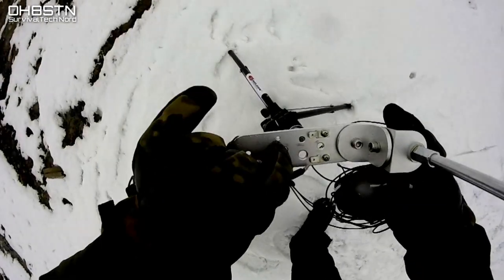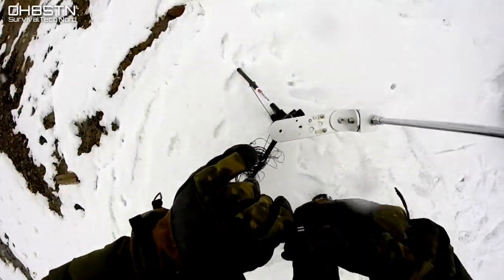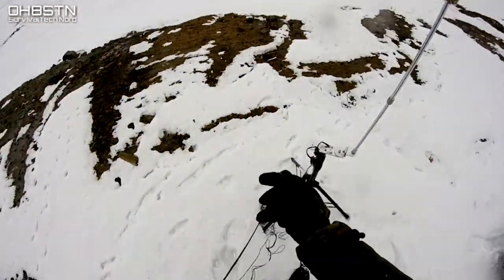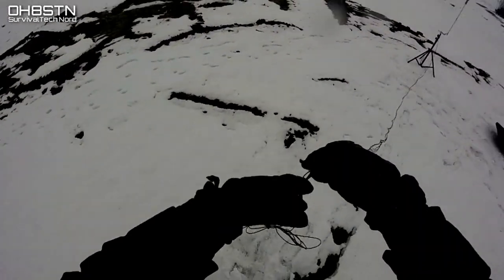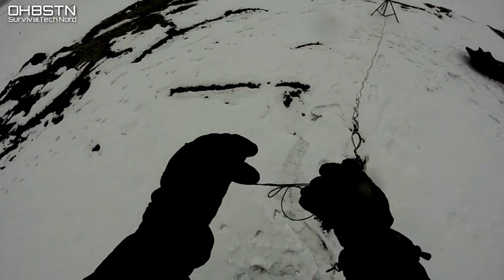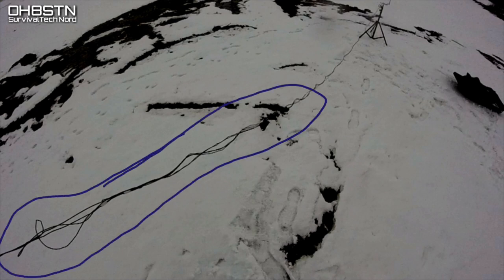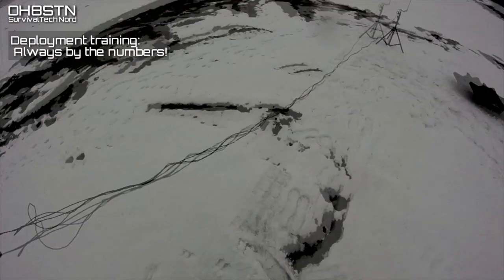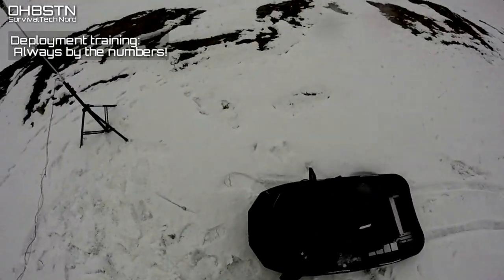Some of you may be noticing my frustration interacting with the counterpoise. At this point, my fingertips were already getting cold and my goggles were icing or fogging up. That frustration was short-lived — almost immediately when I turned on the radio, I had my first sked with Italy. Fail number one: my counterpoise wire was not completely extended, which would definitely be the cause of the SWR problems I had at my initial tune-up. I noticed and corrected it before I started operating, but it's a reminder to do things by the numbers, because you might not be able to see when deploying your antenna.